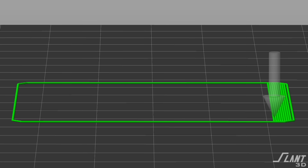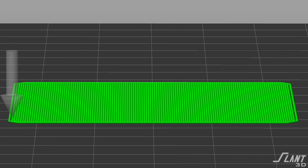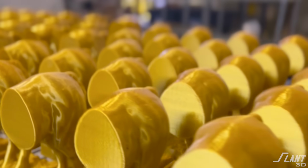But the issue is that slicers are freaking terrible at making rafts. Here's the issue. Most rafts are designed with a rastering pattern on the base layer so that it can be removed from the bed easily, and then multiple layers on top. Many slicers are really bad at defining how these features work. And since they are dependent upon the slicer that is made on, it's very difficult to prototype a part and then send it into mass production at a giant print farm like ours.